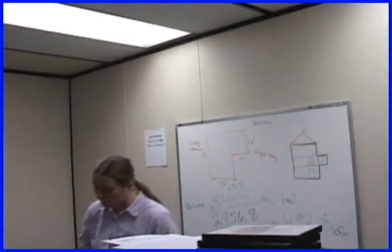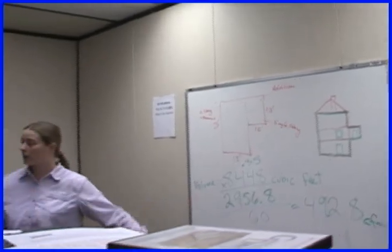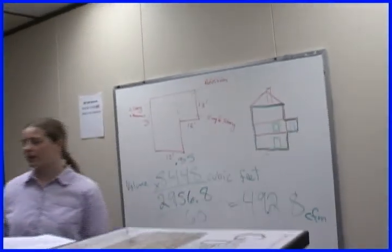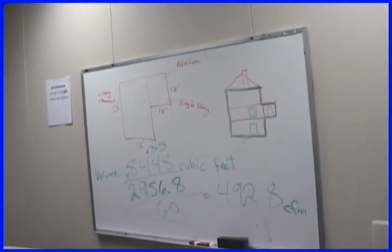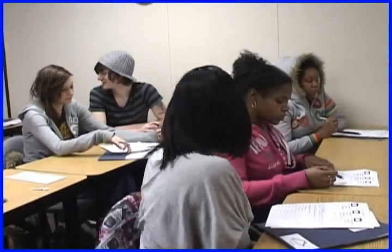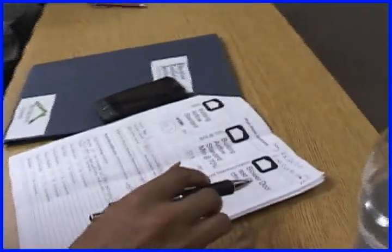Well, 49.28 guys, or 49.28 cubic feet per minute. And it says, if we don't know this information, there's another way to find an approximate value. It's 15 times the number of bedrooms. How many bedrooms do we have? Two. Yeah, so that would give us 30, which is not as accurate, but close enough if you don't have that information. On the page right underneath where the three blocks are, the volume is 8,448.